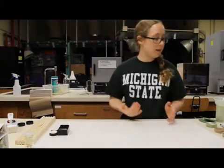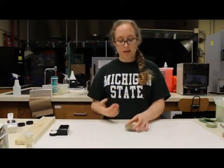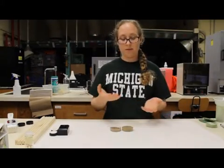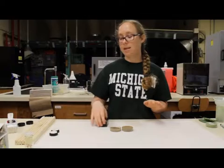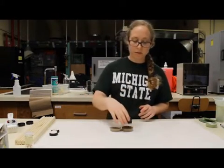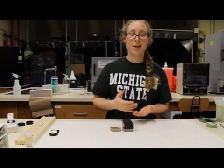Some of the samples I've worked with are soil samples. They've been sieved through a two-millimeter sieve and then placed into a petri dish. This way you can fill the petri dish up and have a nice flat surface with the same distance as the probe was to the reference tile. All you do is place the probe holder with the probe over the sample and that distance should stay relatively the same.